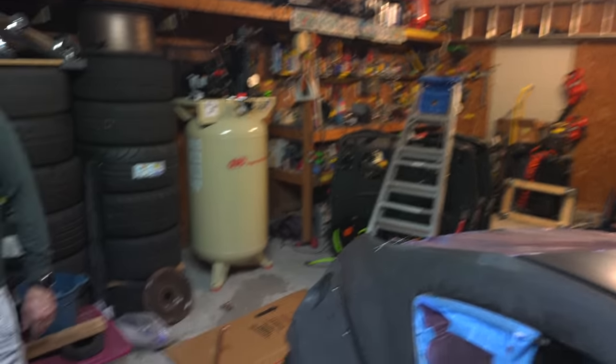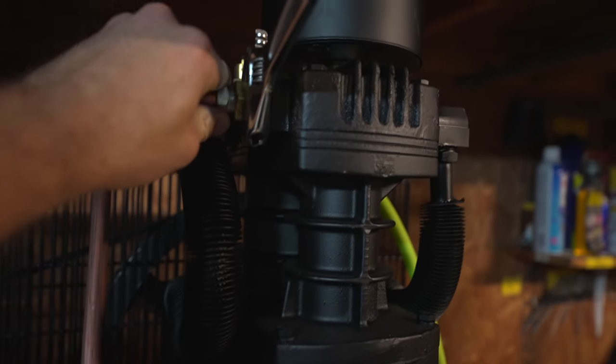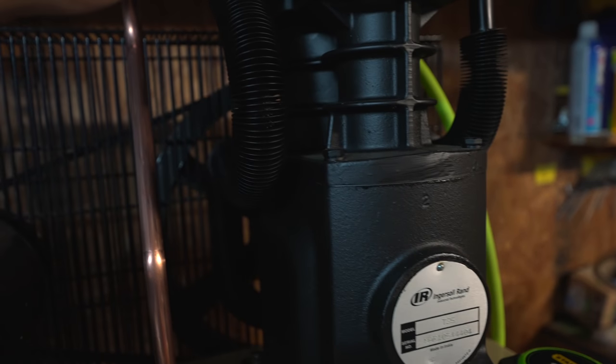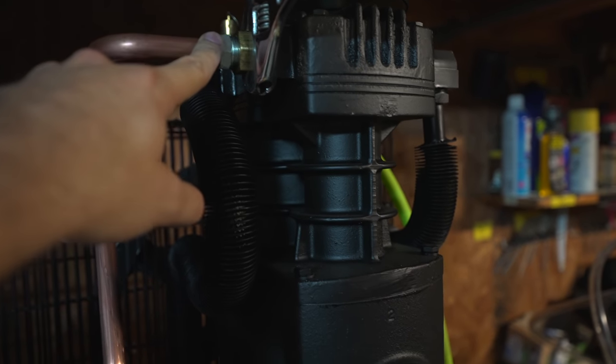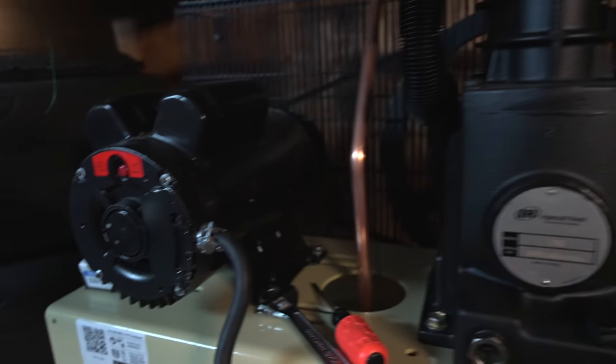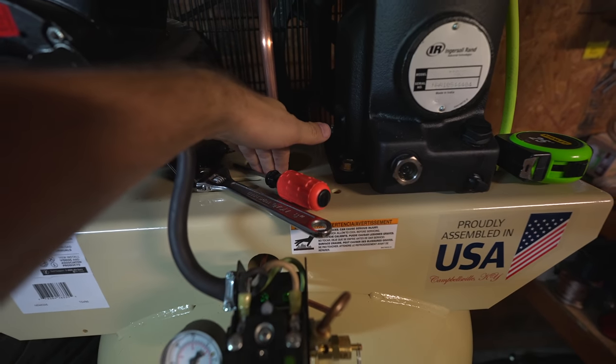If you're still a little confused on what exactly we're doing — we are essentially creating a way to trap all of the moisture coming out of the compressor. As the air gets compressed through the cylinder head and put into the tank, it's super hot, and as that air cools off it condensates and creates moisture. That's why there is a drain valve at the bottom of the tank. Several YouTube videos talked about adding an after-cooler, so I've ordered a transmission cooler that gets mounted to the back with appropriate routing and its own water trap, then comes around the back side of the compressor and into the tank.